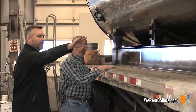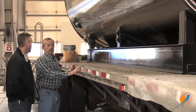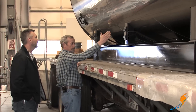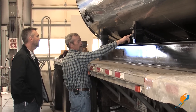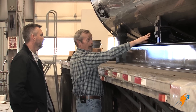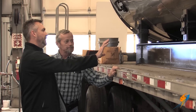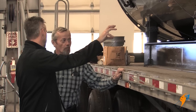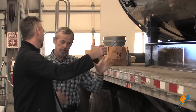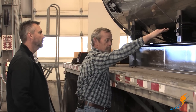Now why don't the front legs have bolts on them? Because you just make it grow one direction. So you have a solid one at the front, and then at the rear there's a plate at the top and bottom just sitting on top of one another so it can move. But you have to loosen the bolts up — so as this is shipped, they're tight, and then when it's installed on the job site, these bolts need to be loosened up so that they can move.